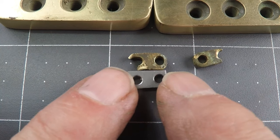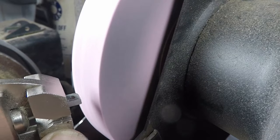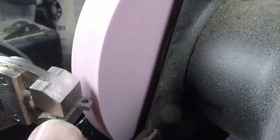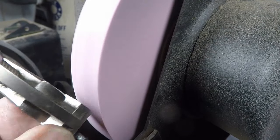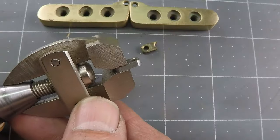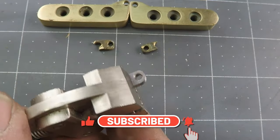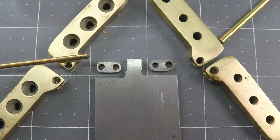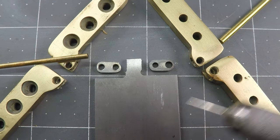There's the old and new parts. I cut out the new part on the milling machine by milling it out, and then I'm using a jeweler's hand clamp to hold it up against the grinding wheel to make that radius. This is a really neat tool — I knew when I bought it I'd find lots of uses for it. If you're enjoying the video please like and subscribe, and you can support me on Patreon using the link below. This tool is used for holding rings when jewelers work on them. There's the first one — I cut it out with two cuts basically using an eighth-inch milling cutter.